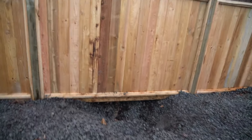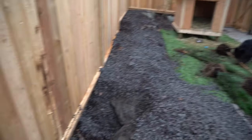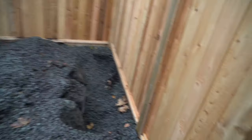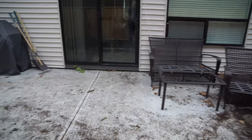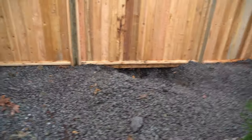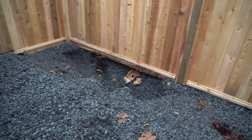I've got a whole bunch of timber coming today. I've already measured out my holes. Basically what I did is I measured off the side of the house and then I measured here, then measured off the other side and matched the centers so they're lining up pretty well. I've dug a little trough to see where it's going to line up best. I've ordered sono tubes for this project so we can bury the sono tube and then put concrete in to hold the posts.